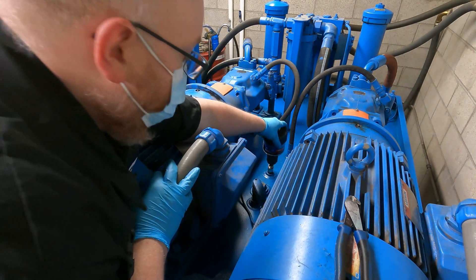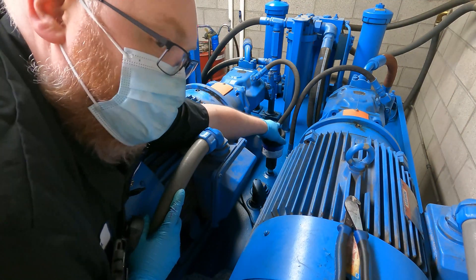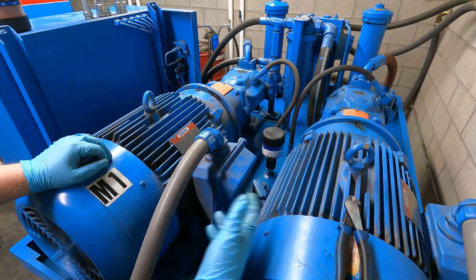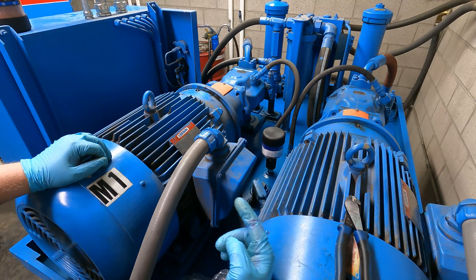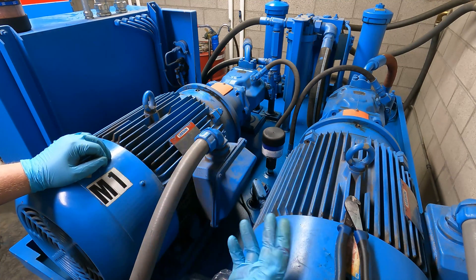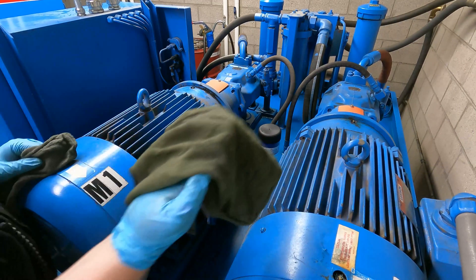There's a little o-ring on there, so we just want to get that sealed — you don't have to have this super tight. The main point of this is just to pull water out of the oil, which is important because it will really help improve the lifespan of the oil so you don't have to change it as often. Plus, water in the oil coming in contact with steel is going to make it corrode quicker.